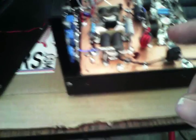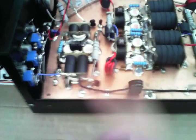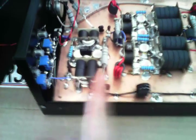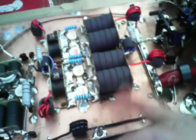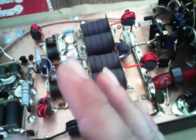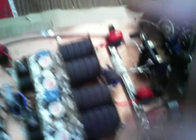I strapped down a few of these wires like the 316 here — it was a little loose. Also, I re-ran this hot wire here going to the input, the driver output transformer on the driver. The choke was sitting over here on all this, and I just wanted to get that choke away from all that and get it over here by itself. I went ahead and strapped that down right there, and re-ran that. One other thing — this hot bus, man, is small. I came close to just taking this hot bus up and replacing it, putting a bigger hot bus on there. But what I did to reinforce the current flow is I went ahead and got me a 14-gauge wire and got that joker strapped across that bar for you, man. It could kind of help with that current flow to get that current from here over to this transformer a little better.